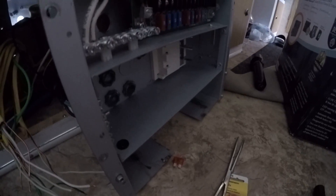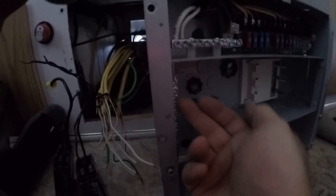I want you to get a look now. I've disconnected basically the 110 coming into this old box, by taking the neutrals out off this bar that sits in here. The neutral being all these whites, and then I've taken my grounds off that came in on this sidebar over here. And those are the green here and all these copper wires.